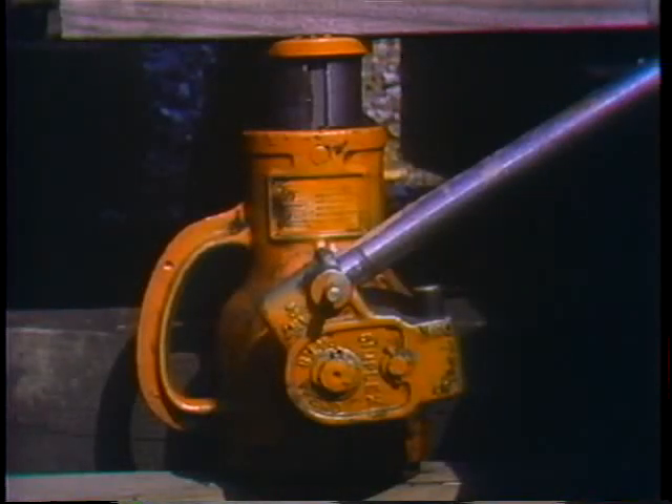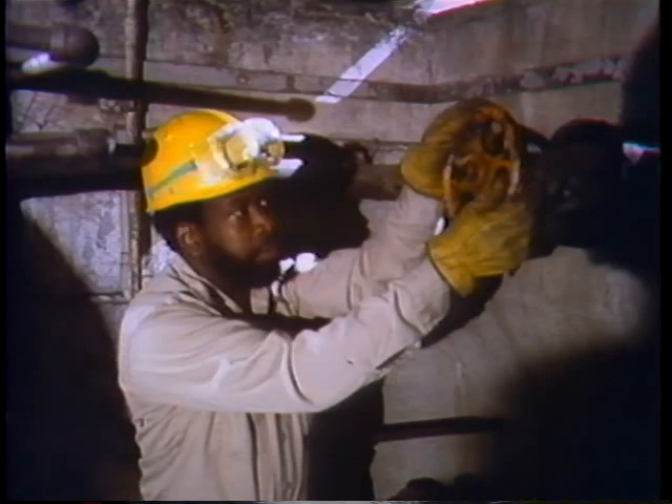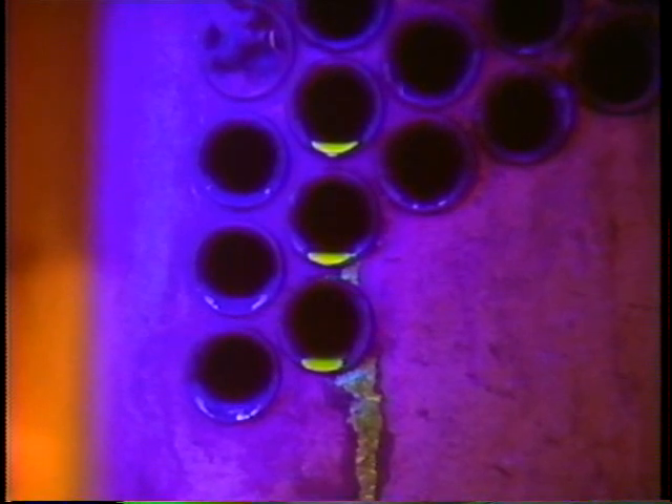After the water side of the condenser has been drained and cleaned, jacks or supports are placed under pads on the condenser. This is because the shell of the condenser is going to be flooded with water. The jacks and supports are necessary to hold all the extra weight on the shell. Remember that many main steam condensers are suspended below the turbine and they just won't hold up under all the water's extra weight. Once the supports have been put into place, the operators flood the condenser with clean water with the fluorescent dye added. Any leakage from the shell into the tubes or around tube ends will become visible under black light. Black light is the light produced by an ultraviolet lamp — it causes the dye to glow bright green. Wherever there's dye coming out from around a tube end or out of a leaking tube, it'll be easily visible using this method of inspection.